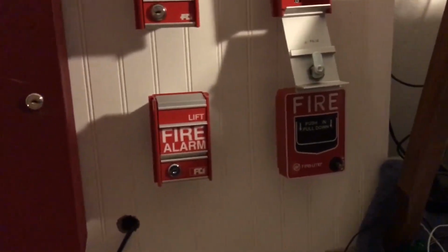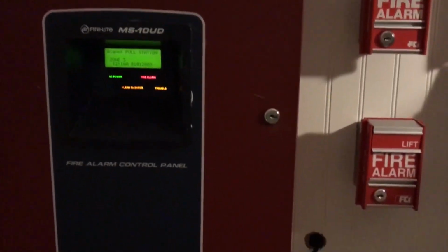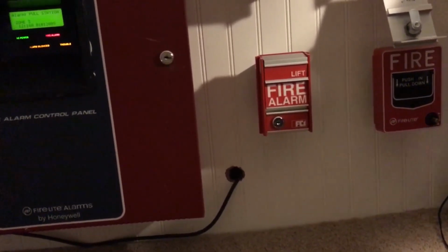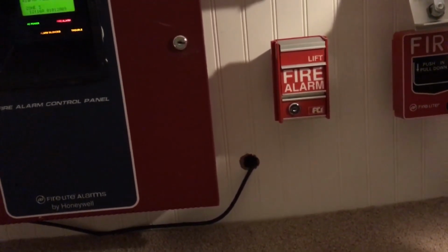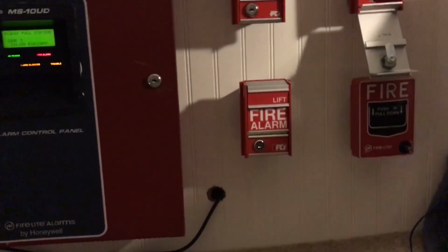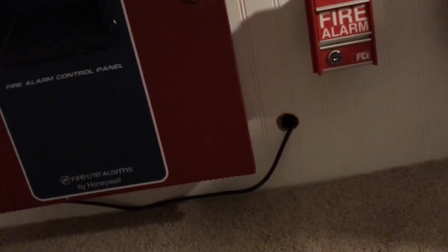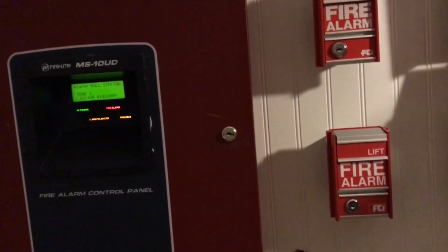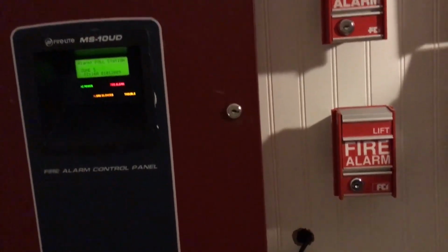So, yeah. For this one, I actually have to reset the pull station, because I actually have to reset the... I believe, don't I have to reset the panel to go into programming mode? Yeah, you have to reset the panel, because if you try going into programming mode, you won't be able to do anything. Alright, so that's what I thought, yeah. So... I gotta reset the pull station. You can go into the menu, and you can go into read status mode, but you can't enter programming mode. It won't even let you press the choose button. Alright. Yeah, that's what I thought, so...